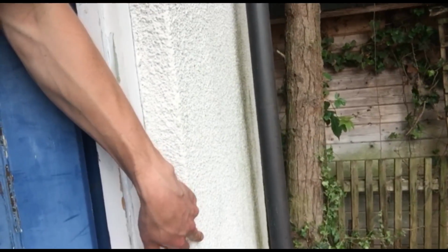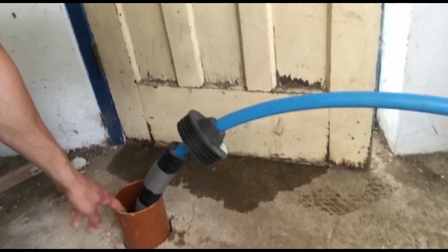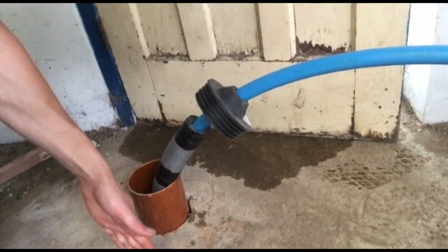So what you need to do, the regulations around in our area, and I've checked on various council websites because I couldn't find the regulations for our area for a while, so I just found some on Google, and it's all the same. Basically, if you're installing a water pipe into a building, if it's going to be 750mm or more away from the external wall inside the property, then you don't need to insulate this tube coming inside. But because we're going to have some cabinets here, our cabinets are going to be something like just finishing here, and we want them to be within the cabinet.